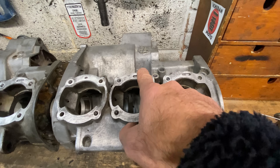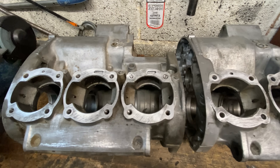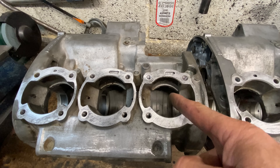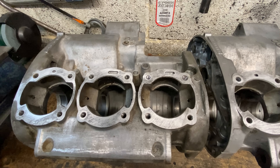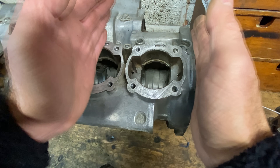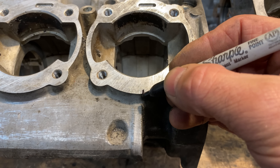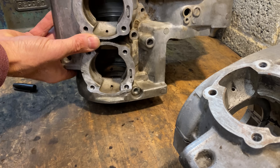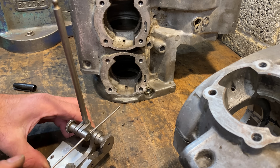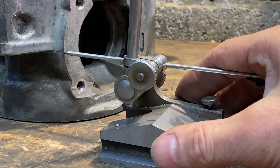With both sets of crankcases on the bench, the first set will be cut in the middle and I'll keep the right hand part, and the second set will be cut there and I'll be keeping the left hand part. So two and a half cylinders plus one and a half cylinders equals four cylinders. The next thing I need to do is mark a line next to the crankcase mounting point, turn the crankcase on its side and use my scribing block to scratch a line around the crankcase — this is where I'm going to be cutting with my hacksaw.